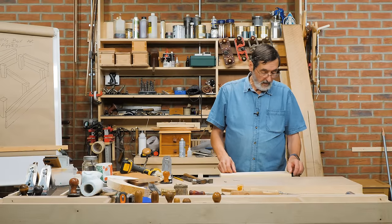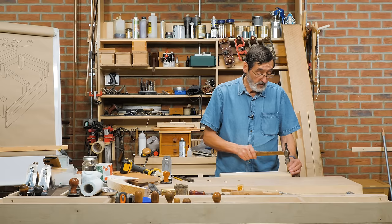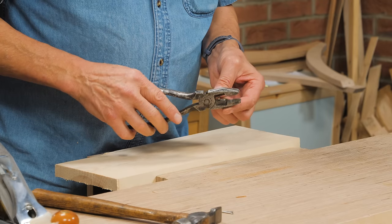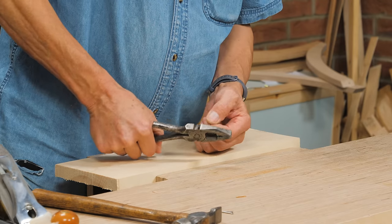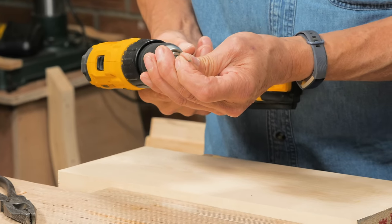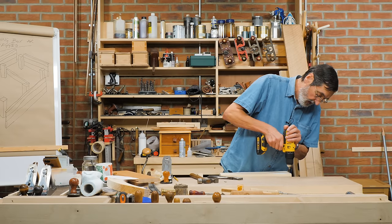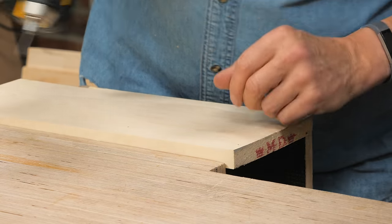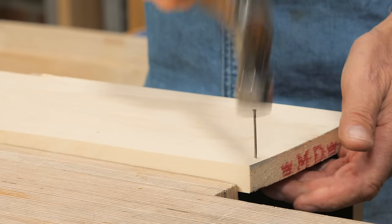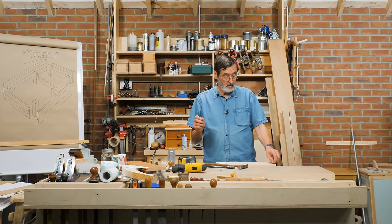Sometimes when you've got to drive a nail into the end of a piece of wood, if you drive that nail on its own without pre-drilling, there's a good chance the end of the wood will split. So what we do is take a pair of pliers and cut the head off the nail — just about any nail will work. Cut the head off, chuck it into the drill driver, cinch it tight, and then you can drill a hole anywhere you like. Take your other piece of wood underneath, then drive your nail — it fits perfectly into that hole and it won't split the wood. It's a perfect solution.